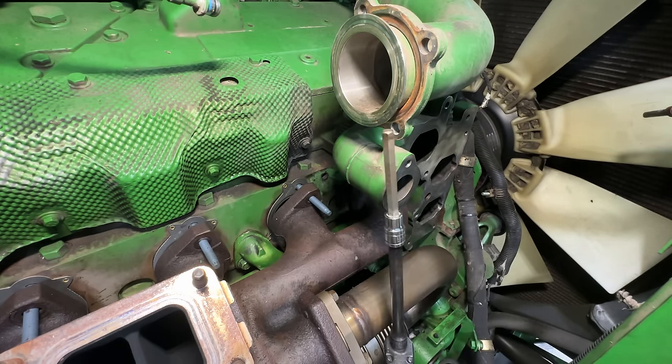And some extra propane tank in there, but in there, it's all the wiring harnesses that I've replaced that had good connectors, and I just snipped them off. So this thing is literally full of every pigtail you can imagine off an engine harness or chassis harness. I got a little bit of everything in there. So when I'm working out in the field, I always have a connector, usually. And I do carry some new connectors as well in that electrical organizer on the other side.